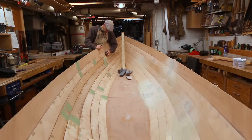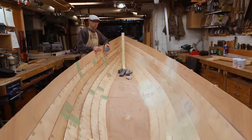If nothing else, it's very convenient, and it is epoxy-based, unlike Bondo. So this will hang on to bare wood nicely. Whereas Bondo, yeah, it will, but it's not intended to. Because it's polyester-based, and polyesters don't hang on to wood super great, which is why in your fiberglass boats you tend to have these engine bed stringers and transoms that delaminate from the rest of the boat. Because those two just don't go well together.